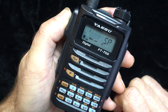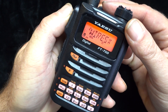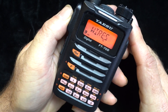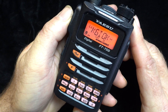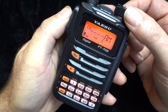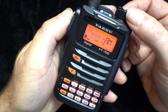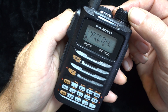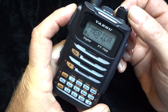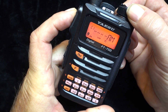WiresX — let's talk about WiresX for a minute. While the FT-70 doesn't have full WiresX integration, it does have most of it, and you can absolutely access WiresX from the radio. Pushing the F key and the AMS key activates a WiresX node, and then the selector knob can be used to either manually enter a room number or flip between up to five saved rooms and hit PTT to access the room.